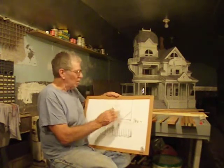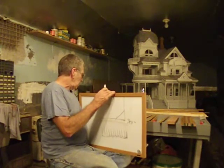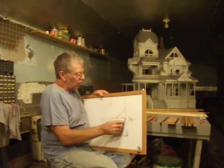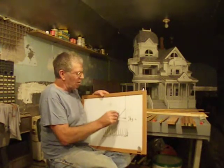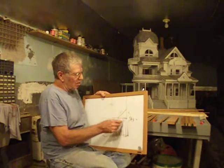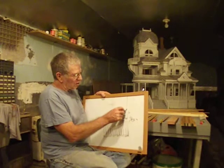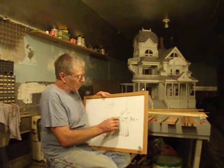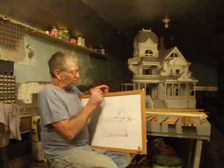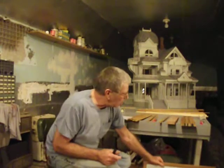If it's not six inches, it's not square. Actually, the numbers are three, four, and five. Measure three inches this way, four inches that way, and it will measure five inches across. Three, four, and five — try to keep that in your head all the time.